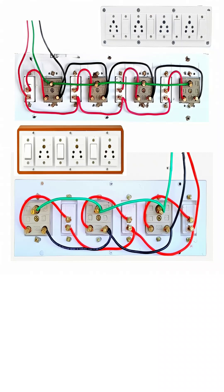In this board, we can also observe that the wires are connected in a loop or parallel wiring method. This means that all sockets and switches are independently connected to the supply, so that even if one stops working, others continue to function. This is better than series wiring, where a fault in one point can affect the whole system.